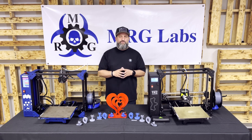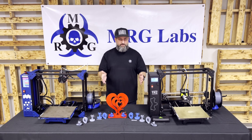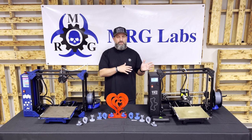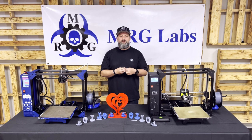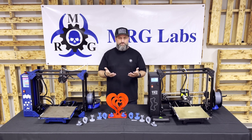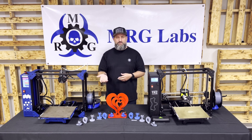Let's dive deeper into each of these prints and the findings of each. Since they take different sized filaments, I was sure to buy the same brand spec filaments, with the only difference being the diameter. I often choose IC3D for my high-end printing work, so it's no different in these comparison models. I typically print in ABS, which takes a lot of getting used to and isn't recommended for beginners, so for these comparisons I'm going to be showcasing a mix of both PLA and PETG, which are a lot more common for general users. All parts were printed in both PLA and PETG, with the gray being the PLA and the blue being the PETG in this video for reference. When using highly hygroscopic materials such as PLA, be sure to store it in a humidity-controlled environment, such as a dehumidifier or a bag with dry desiccant in it.